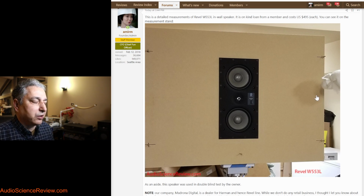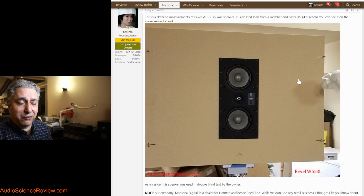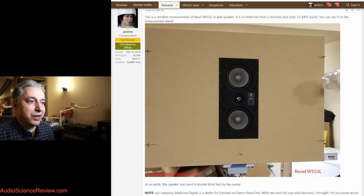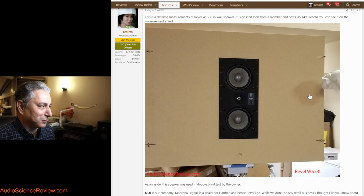Fortunately, this Klippel near-field scanner that I use, and you can barely see the stand that it's on, it's a special module, very expensive, cost 4,000 euros just for the software, about $5,000 or $6,000. And this is the microphone, by the way, and I've put absorbers around it to stop the reflections from the microphone stand, because when the wavelength gets small enough, they become significant relative to the dimensions of the microphone mount that's on a boom here. And they reflect back and then reflect forward and so forth, so you get a little bit of comb filtering. But fortunately, the wavelength is small, so you can put just 1 or 2 inches of padding in there, and it'll absorb it. And I borrowed quilt padding from my wife and made a makeshift one, and it's worked, and I haven't messed with it.